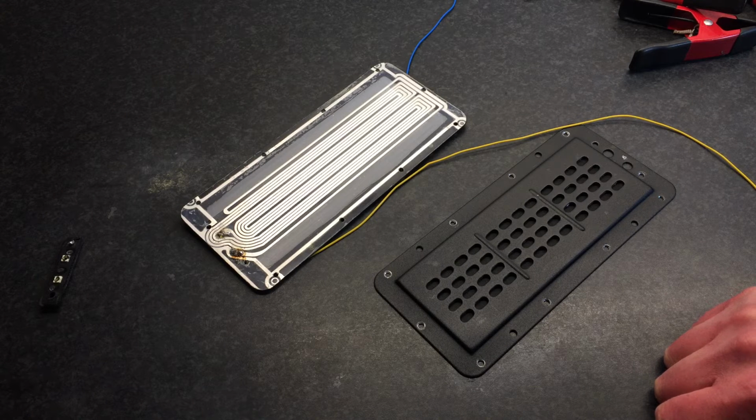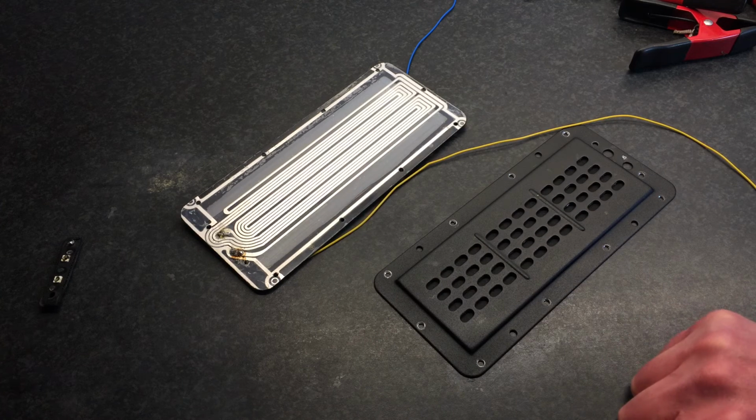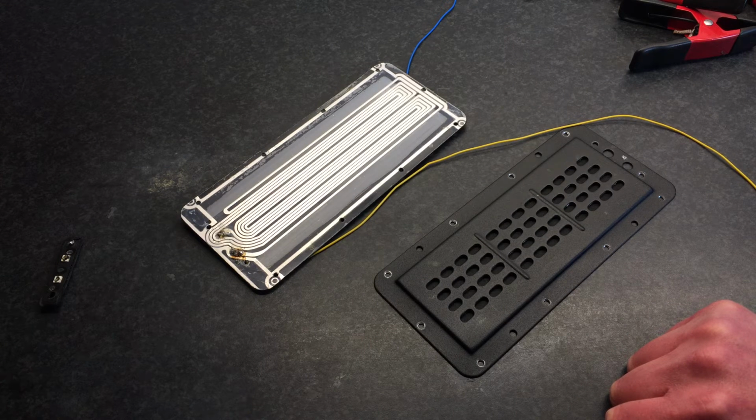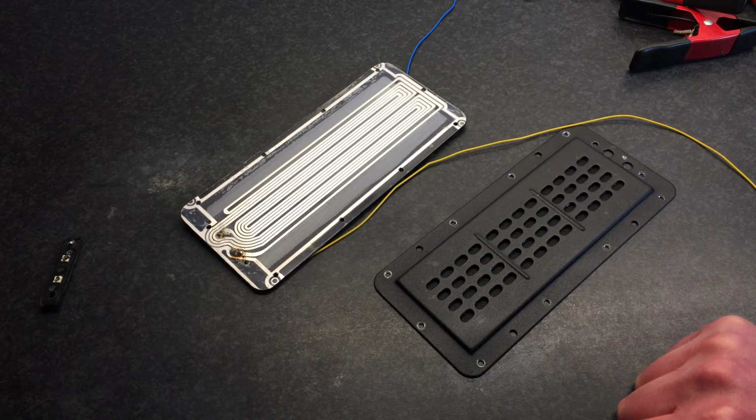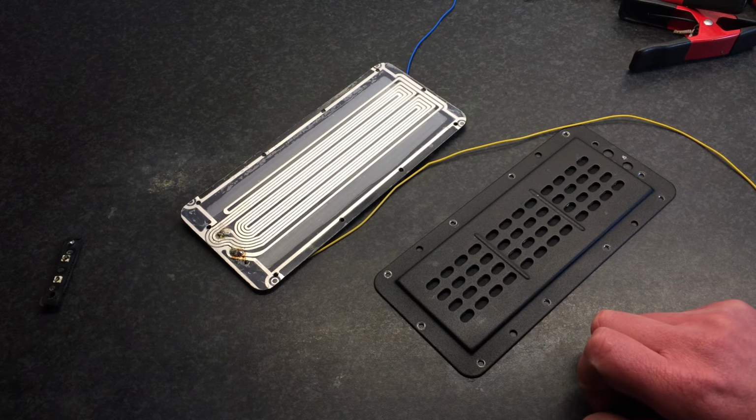Is there anything else to say about this? Not really. Well, it's 3.5 ohm, so this aluminum is quite thick. Oh, I measured one and it is single-ended. So I'm not sure how it will look in push-pull mode, but single-ended it reaches almost 20k. It falls off a little bit. That's kind of surprising. And you don't see the huge peak you probably get when you have it in push-pull. But we'll see about that.